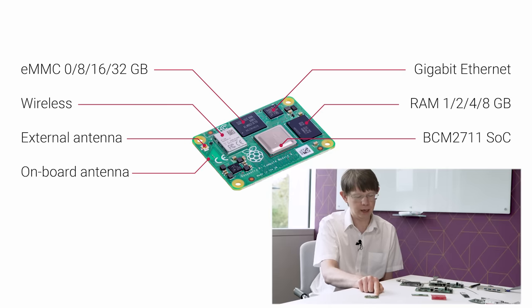At the top over here we have the Ethernet PHY. Now that's a novelty — we haven't previously put Ethernet on a compute module. So we've got that built in, and that means it's now much easier to interface to Ethernet, because all you now need is just the external mag jack — no extra silicon needed on your interface board. Now is this the same PHY as on Raspberry Pi 4? No, it's an enhanced PHY and it supports the IEEE 1588 timing standard, which allows you to synchronize devices on your network. It's a more industrial grade PHY than we've used before.